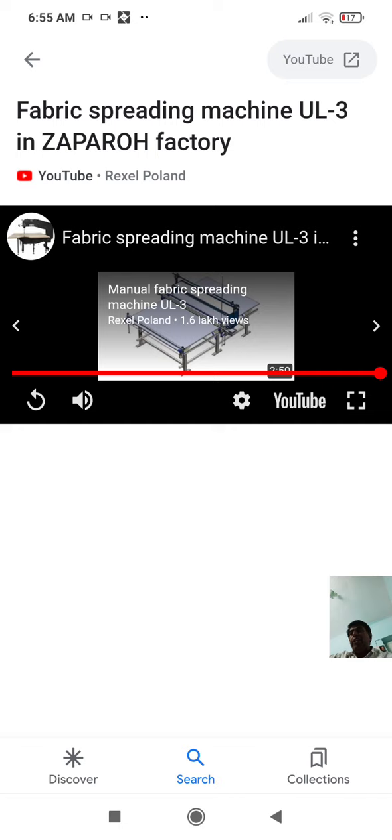Various factors that can affect spreading should be checked, such as ply alignment, ply tension or slackness, bowing and splicing. The greater the variation, either width or length alignment, the greater the waste in precision cutting, because the ends and sides must be trimmed to the narrowest and shortest plies. A tight spread will contract after cutting, resulting in smaller or skimpier components than what should be. A slack spread possesses excess length within the stipulated end of the spread.